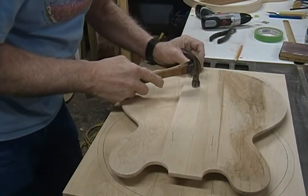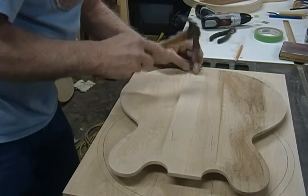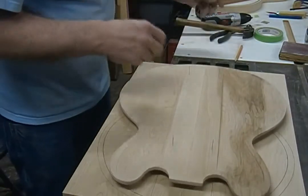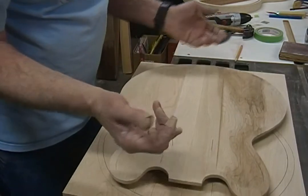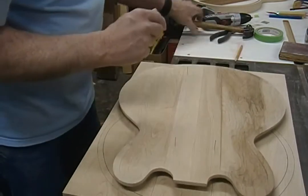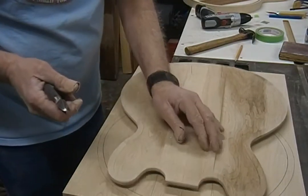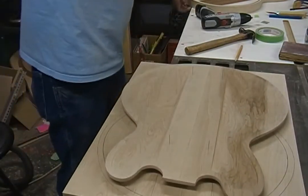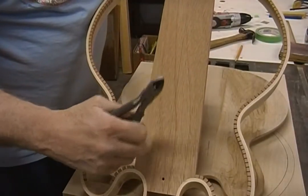And if I were going into something softer, I probably wouldn't have had to use a pilot drill, but the pilot drill gives me the opportunity to determine how deep I want the holes. If you're just pounding these in, you can't really tell how far you're going. So the place where the orientation of the brad might make a difference is in the grain of the mahogany.